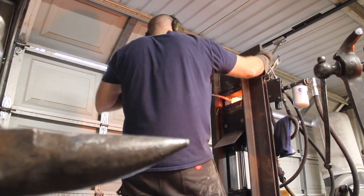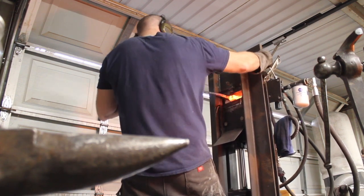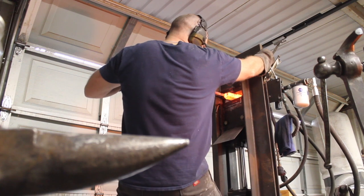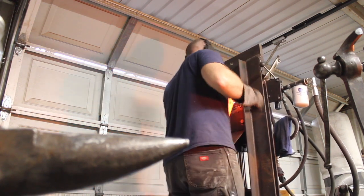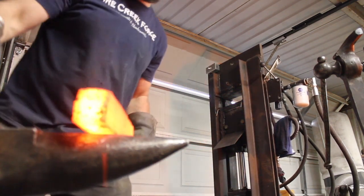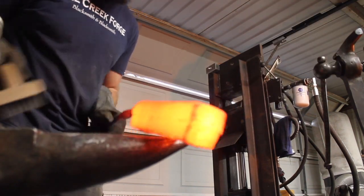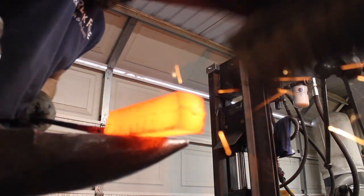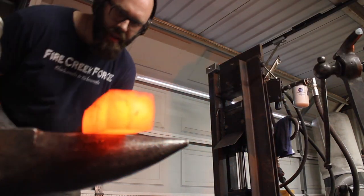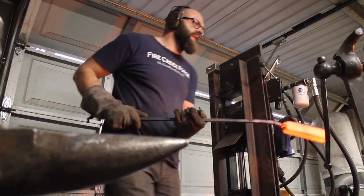It's welding up. When I forge aggressively here on the bias like this, I do have some minor D-lams on the outside coming up on one side from where the ends of the billet didn't fully weld, and as you stretch that out, they lengthen out, so they look worse than they really are. But I'm hoping those are just pretty shallow and can easily be ground off and not really affect anything at all. Just losing a little bit of material, and you can see it right there.